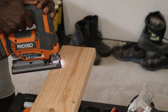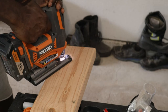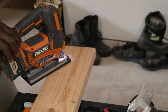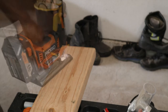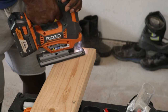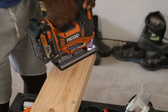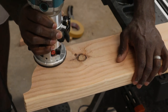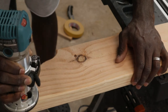Now let's talk detail. I made a template out of some scrap plywood to trace onto the ends of my beams, again using my WORX table to keep it steady. Using my jigsaw, I followed the line as closely as possible. I did forget to turn off the slow start feature on my jigsaw, which caused the blade to bind pretty bad. Safety tip: always remove the battery or unplug the tool before trying to right the wrong — just trust me on this one. Once that was sorted, I went with a small roundover on the beam edge and I think it came out nicely.